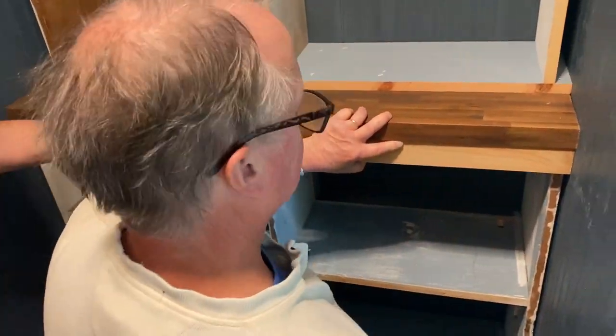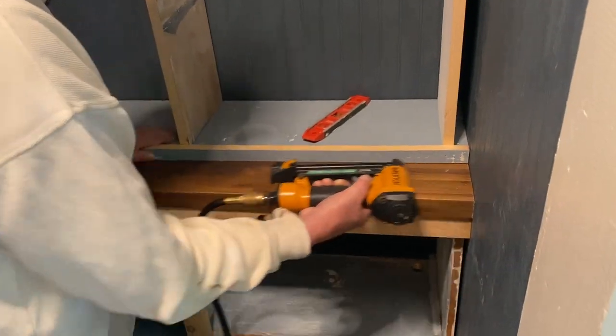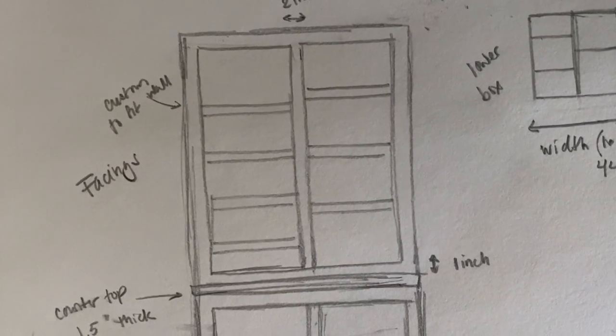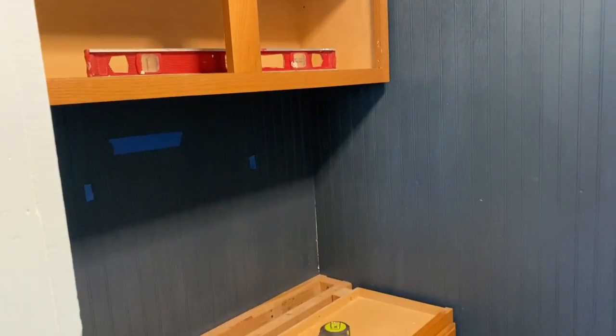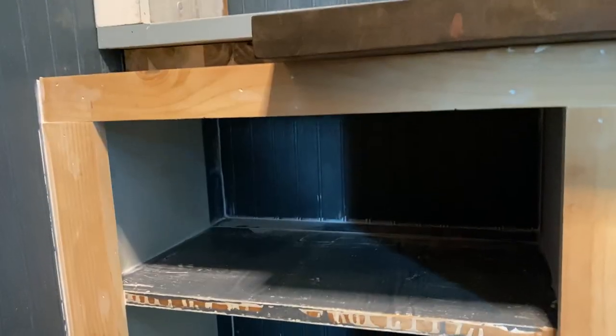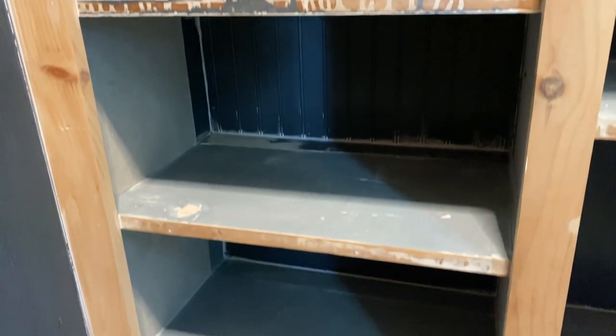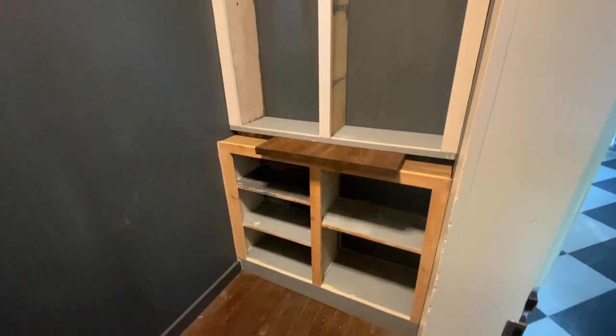After much discussion and problem solving, the facings went on. The standard width was two inches, with a one-inch piece along the countertop and custom-cut pieces along the sides to account for the slanted walls. We also dropped the height of the left upper cabinet from where we had previously installed it by a few inches to make it more accessible and to help mask the under-cabinet lights we'll add later on. End of day two — we didn't get to painting today, but we made so much good progress. The cabinets are basically totally installed, I started caulking around the bottom to seal all the little cracks and make it feel really built in, and we got the side panels put in on the upper and lower cabinets so everything is prepped and in place for paint.